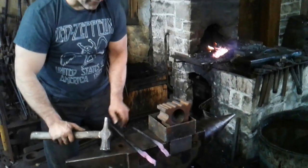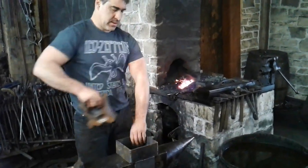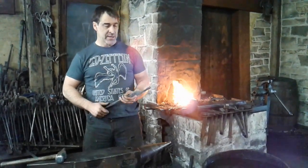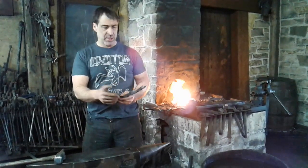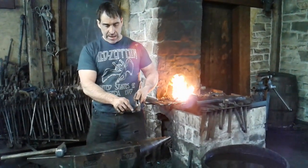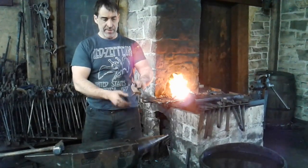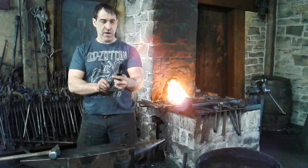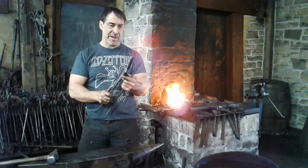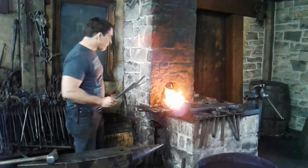Before assembly, I just want to forge out the other two specialty tongs I'll be working on. The next pair is the box jaw tongs, or blade tongs as they're sometimes called. I've got extra long jaws on these to start, and what I've done is actually split the longer of the two, going back about an inch and a half — I did that on my bandsaw, though you can use a hacksaw or a hot cut with a chisel or hot cutter. I find the bandsaw very convenient. I've got my slit in there, so now I'll heat these up and form them into shape.